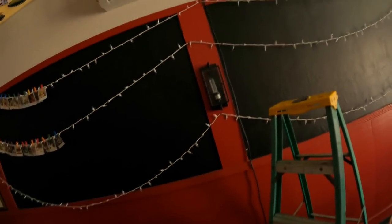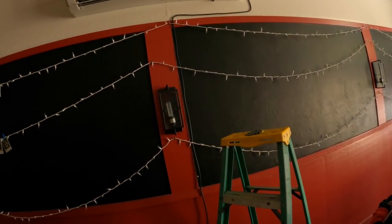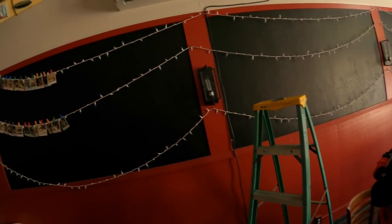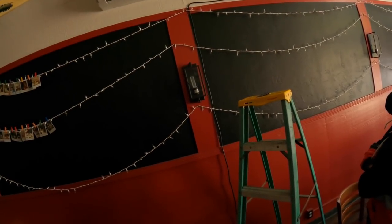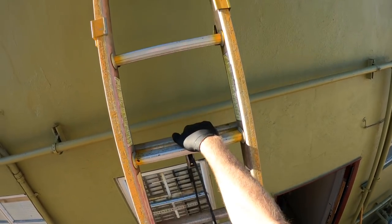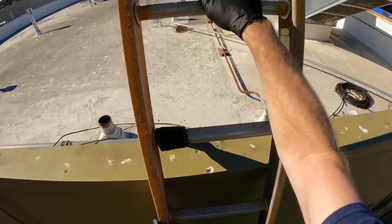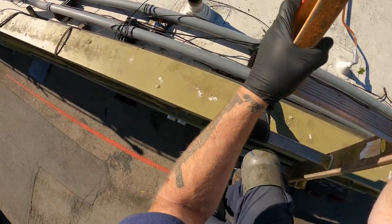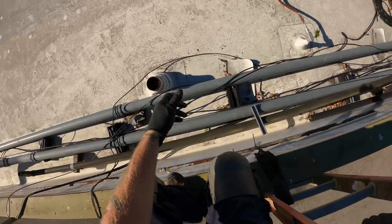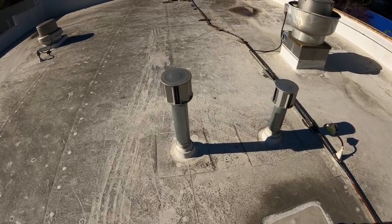But let's let it go through a cycle and do some heating and get the chill off the store here real quick. Right on. And then we will carry on here. Good deal. Yeah. All right, that one didn't take me too long to figure out. It wasn't throwing me a loop, but for a minute. You know, you get to working on so much stuff, your brain's got to kick back in and go, oh yeah, the old condensate pump with the float switch, right?